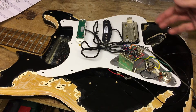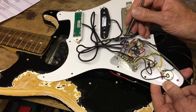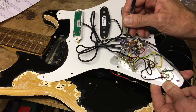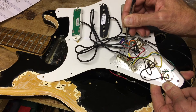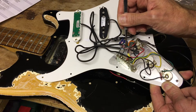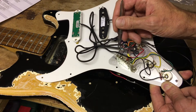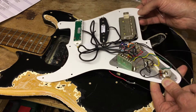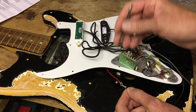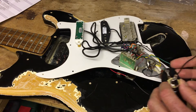Here it is all finished — the little switch has been put in. The red and white wire come from the humbucker; you join those together and bridge this one to the volume. You join the green and bare ones to the volume on each pickup. Then finally the black one goes over to the first position. It's important you've got your earth — I'm just running through the amplifier dry and it works, so I was really pleased. There's your earth and there's your input jack.